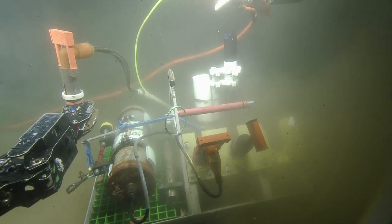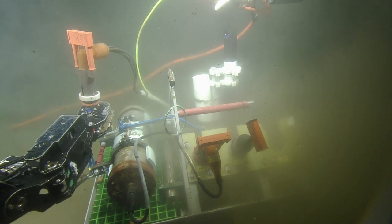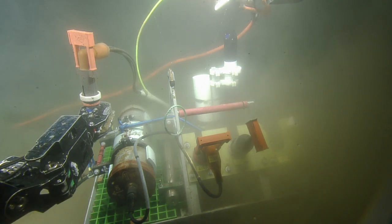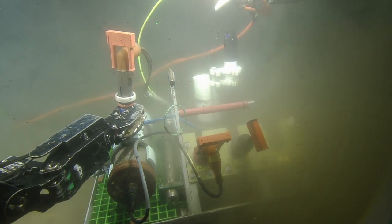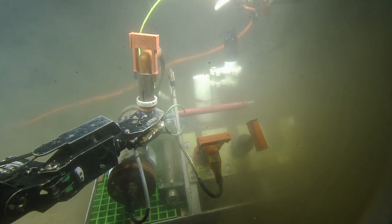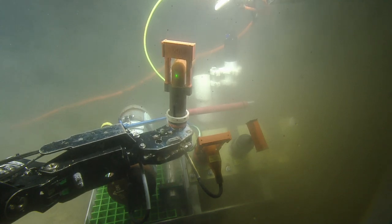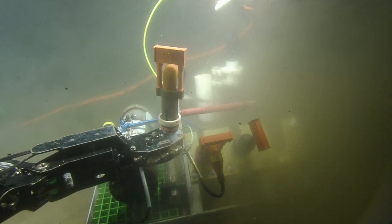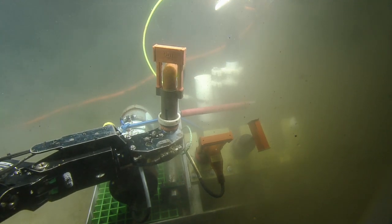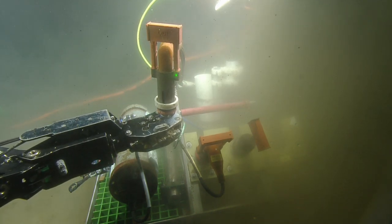Someone on shore was asking what we're up to. What are you guys doing? What an uncommon question. But we just sent down a new platform with a water current meter, pressure recorder, and battery, because we're swapping out an old one with a failed pressure sensor. And this little platform connects to a seismometer we have buried in the seafloor, which is measuring ground motion. And if you measure the water pressure and current, you can eliminate those signals from the ground motion and get a cleaner seismic recording.